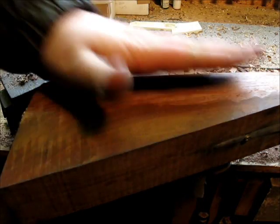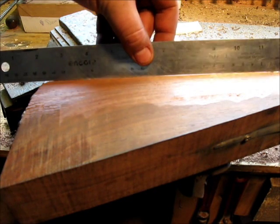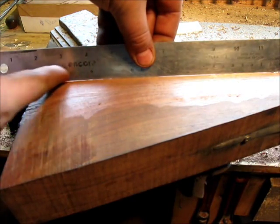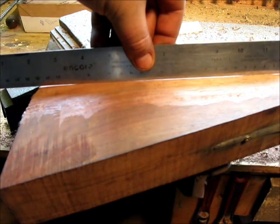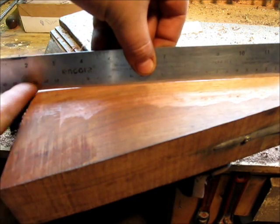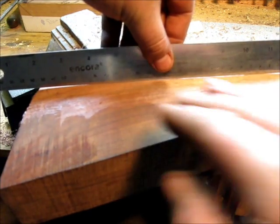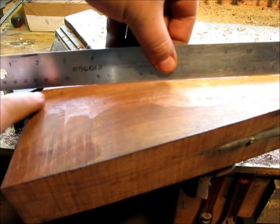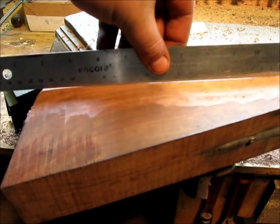You can see I'm starting to work this section right here, this first quadrant. This is how you check to make sure that everything's staying in line — you use a straight edge of some kind, whether it's a ruler or a piece of metal or whatever. If you look at it here, you can see a little light shining through under there, but it's tight right there — so that's a high spot. As I move it this way, you'll notice it kind of gets worse. I've got to take this down quite a ways yet because I'm not even close to the butt plate. That's how you keep your line running straight so that you get a nice smooth radius that doesn't have any high or low spots. Stop and check it with a straight edge and make sure everything's coming out to a nice clean radius that's straight across, down the length of it.